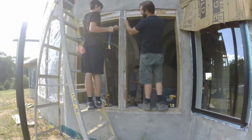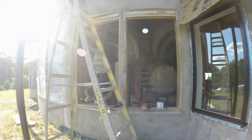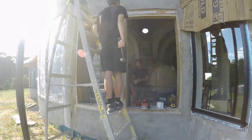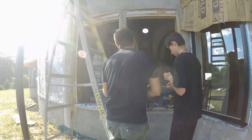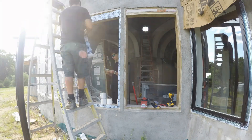That extra wood blocking above and below each window is not great thermally, but it doesn't make much difference in the big picture. The outer part of the buck is curved to align with the curved walls, and then one layer in on the top and bottom is straight — that's meant for the nail fins that need to be straight for the windows.